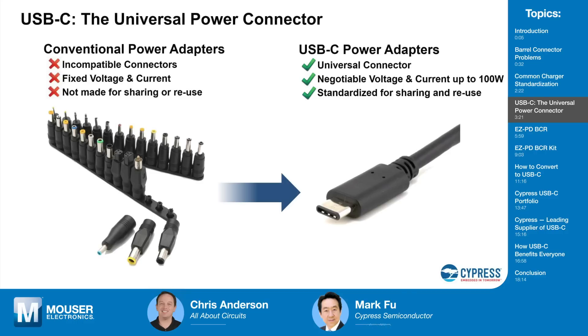Electrically, Type-C is much better than USB Micro-B because it's no longer just USB — it's now pretty much a universal cable that can transport USB data as well as display data, for example DisplayPort, HDMI, or very high bandwidth data used primarily in PCs like Thunderbolt.